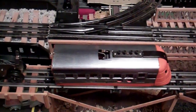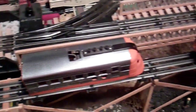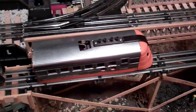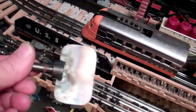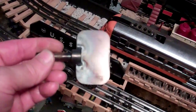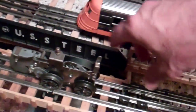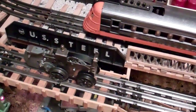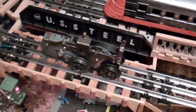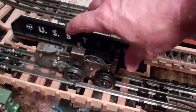I'm going to send the little clockwork motor around — you can hear the whistle — and then I'll run the train as I have it now with power. I had to make this key too because the key was missing, and I made no attempt to make an as-original key. It's a big obnoxious thing but it makes it easy to wind. So I'll release the brake and send it around. It goes a little fast because there's no weight on it, but the impeller inside the whistle acts as a governor. If you run this thing without the whistle, it'll just fly off the track.